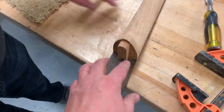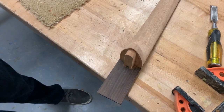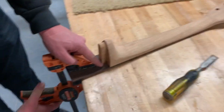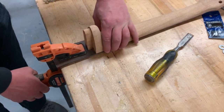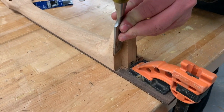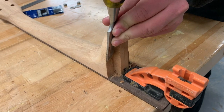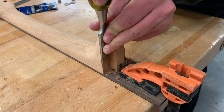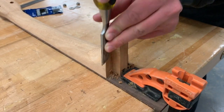The other thing you're going to do is modify this inside part of the neck to try to make that curved section of the guitar match as well. So you can clamp your neck down to a bench top so it doesn't move on us. Then we'll take wood chisels — we can do sandpaper, rasps, all sorts of different things — and we'll try to shape that. You're just tweaking that chisel at a slight angle and kind of slicing down. Now, this is end grain, which is a lot more difficult to chisel, so just take your time with it, making sure that both hands are behind the chisel — never having a hand in front of the chisel at all. That's why we clamp it.